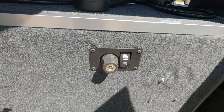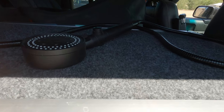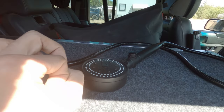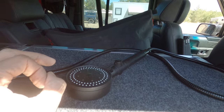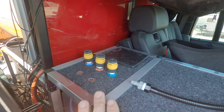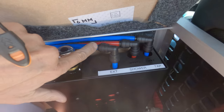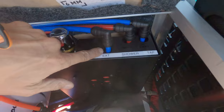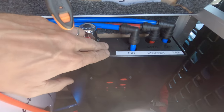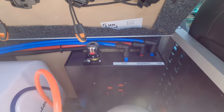If you don't know about John Guest fittings, I highly recommend them — they made this so much easier to do. It was easy to figure out the 90-degree bends; they're all 12mm outside-diameter fittings, just push them in and you hear it click. When I first fired this up a month ago the pump kept cycling, which meant air was getting in — I had a leak. One fitting lower down wasn't pushed in properly and water was coming through, which is why you can still see the marks. I do have a filter on this as well. John Guest also do filters and barb connectors — pretty much any type of connector you could dream of. Even if you've never done plumbing before, this made it easy, and the whole build probably took me about two or three hours.